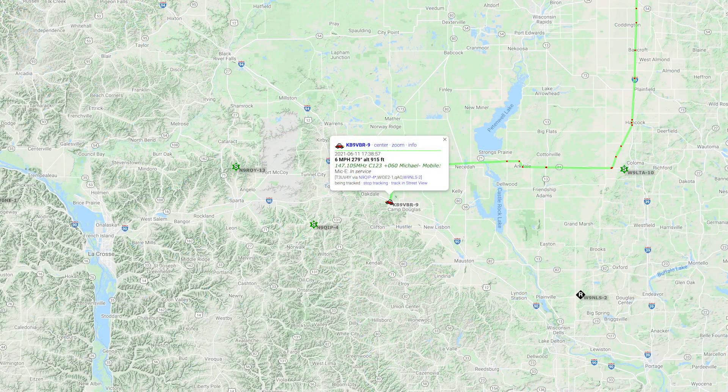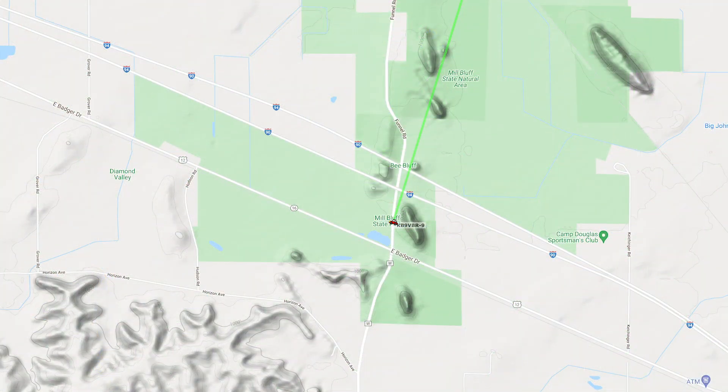This weekend we're over at Mill Bluff State Park in west central Wisconsin. Mill Bluff State Park is really known for its unique geological formations, and we'll talk about those in a second. But first, I'm going to tell you a little bit about our Parks on the Air activation we're doing this weekend — this is K1463. Today I'm trying out a new antenna: the folks over at Chameleon Antennas have sent me a new model called their Lightweight End Fed Sloper. This antenna is designed for 40 through 10 meters, to be used without a tuner — so you can use it on 40, 20, 17, 15, 12, and 10 meters. I checked it out on the antenna analyzer and it seems to tune up well.